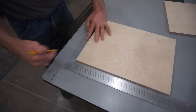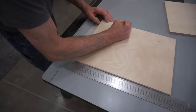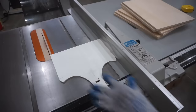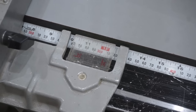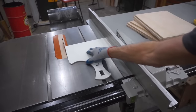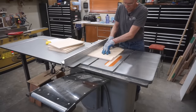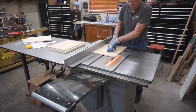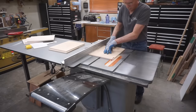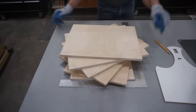And remaining pieces from different pieces of plywood cut in a different sequence were square from the get-go and didn't need any extra attention. At the last minute, I remember to cut these pieces exactly 12 and an eighth inches wide, so there's a little fudge factor for fitting the box joints on the corners of the toolbox after it's glued up. I'm really glad I caught that when I did, because it's so embarrassing to make a pile of perfectly accurate mistakes while the video cameras are running. And it reassures my belief that it's far better to be lucky than good.